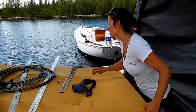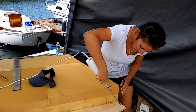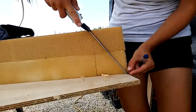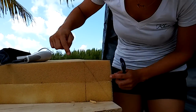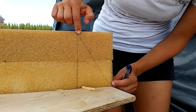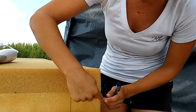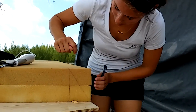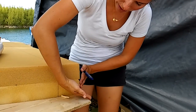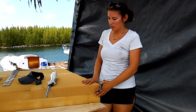Our blade is only about seven and a half inches, so it won't actually make that cut — as you can see, it's off by just about half an inch. So instead, we drew a line from the top of the angle to the bottom of the angle. We're going to delaminate this piece, flip it up, and do this angle. Then once we have that angle, we're going to use the edge of this wedge cutout to finish the rest of the angle. It'll make more sense as we do it.